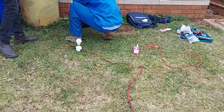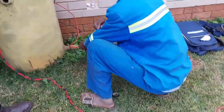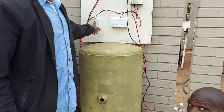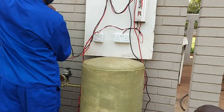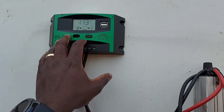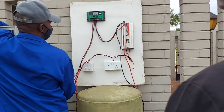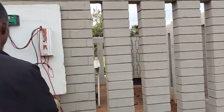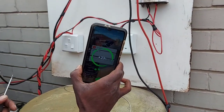The guys will just go and hang these into their individual rooms — they've got a two-roomed house there. It's like they're in their own house. Let's just test the plug to see if that's working. It's now 11.3 volts — it's dropped a little because there's shade and the solar panel is not actually charging. Just the lights we switched on dropped the voltage a little bit. Now we're going to be charging the phone. We've connected the phone — it's at 23% and it's charging.